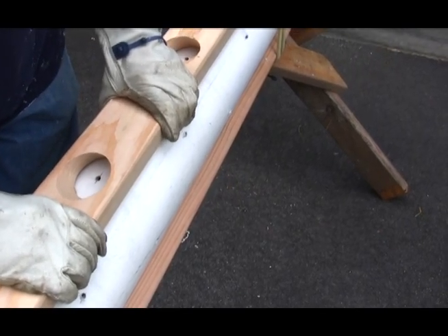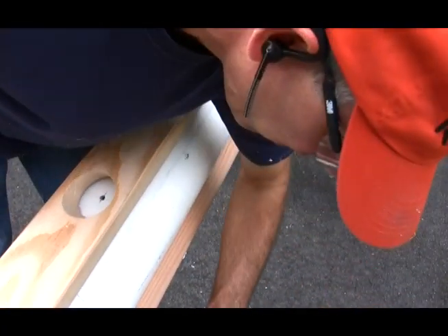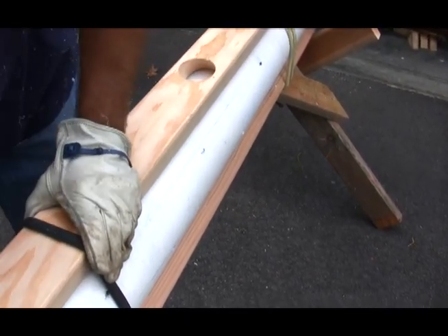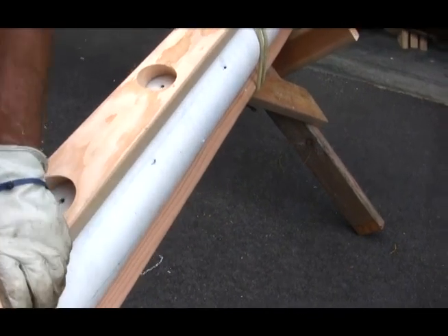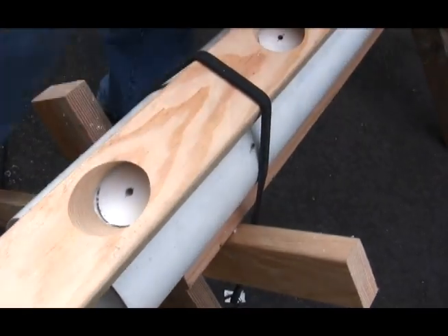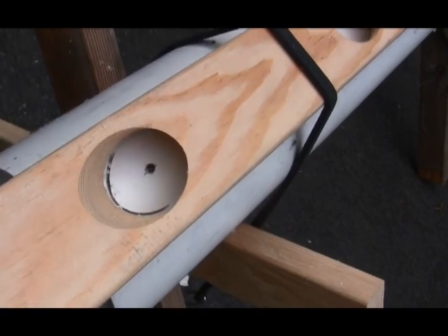On the drill, I have replaced the drill bit on the hole saw with a drill guide that is a quarter inch. It is basically a piece of welding rod that is a quarter inch and extremely stout, and I just took that and ground down the end so it makes a wonderful drill guide. I don't want to cut into any of these holes — I just want the hole saw to be guided through easily with my bit there.